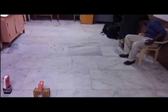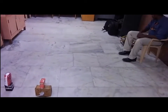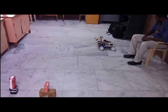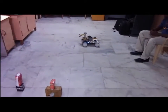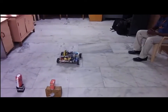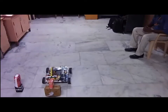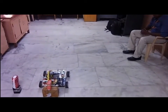This demonstration shows the complete search algorithm of the robot with additional calibration. In this autonomous operation, the BeagleBone Black processor sends control commands to the slave controller to control the DC motors via two L298 H-bridge ICs and the robotic arm, only after calculating the average value of the detection rate so as to avoid false positive detection and errors due to motion artifacts.